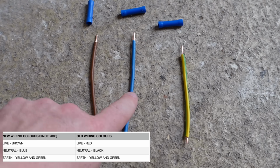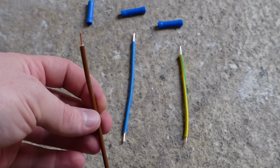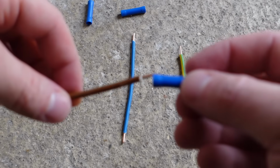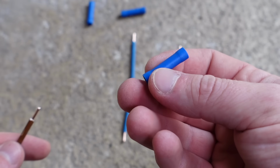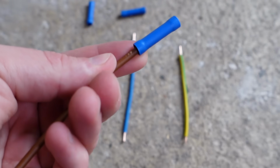So you now have your 3 extensions. You've got the live, the neutral and the earth. In no particular order, let's start with the live conductor. Grab one of the 2.5mm crimps. The links to these are below in the description if you want to grab some. Slide that onto one end of the conductor.